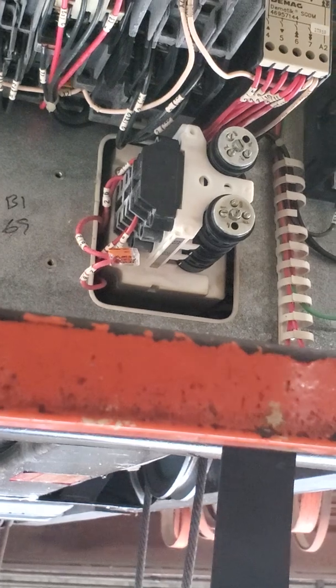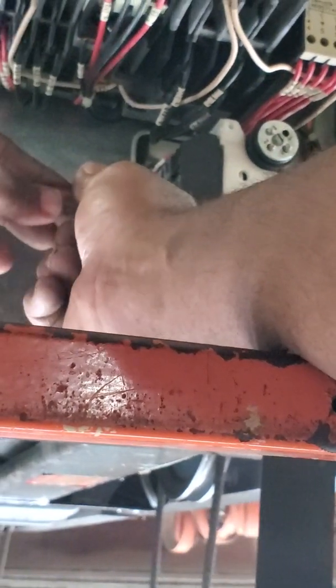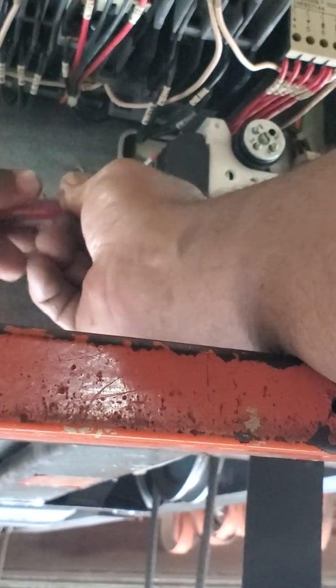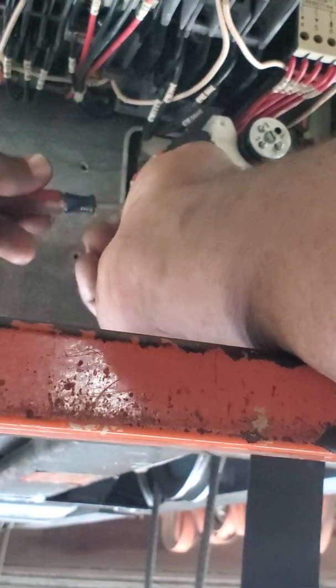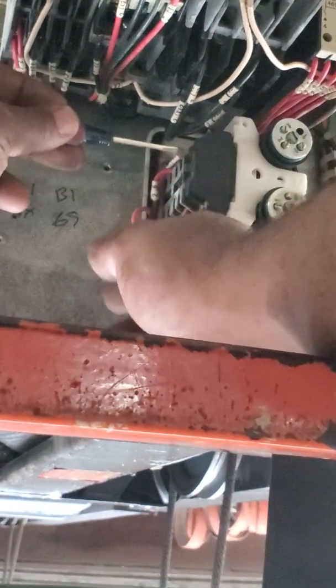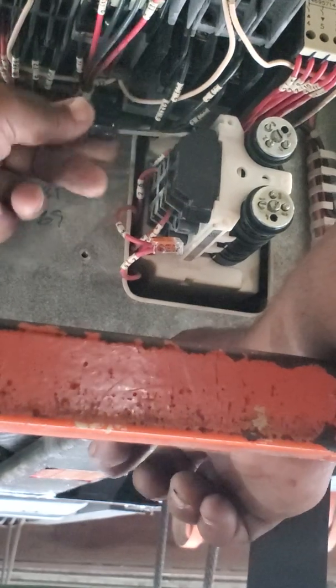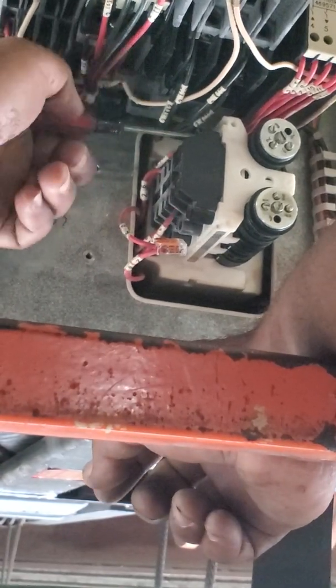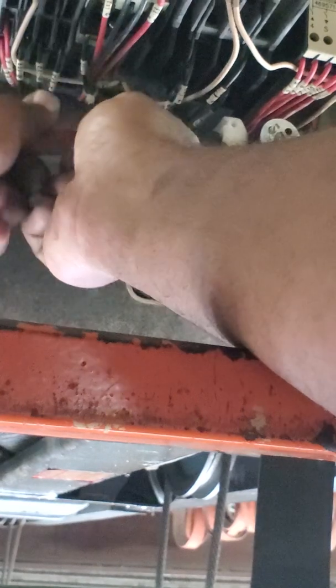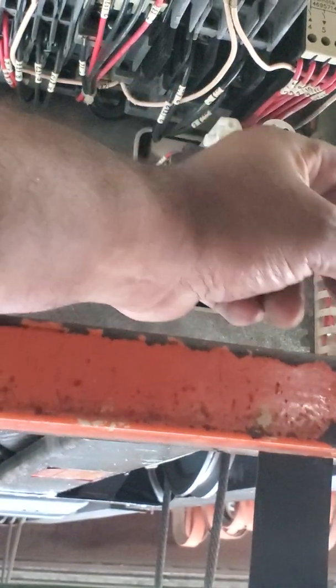Most of the time, since we're still in the live position, we have to work on live circuits to see what the problem is. And that was 500 volts. Most of the time you have a crane deployed — the city is actually pumping out 500, 501, 502. So it varies; as long as you get the same or about the same on all three legs. Some of these places have a high leg on L2. It depends on how they hook it up.